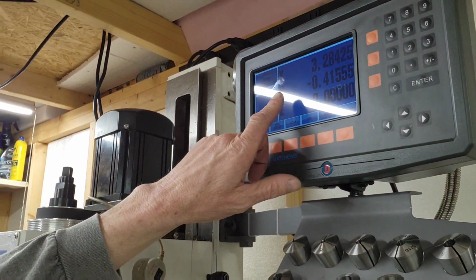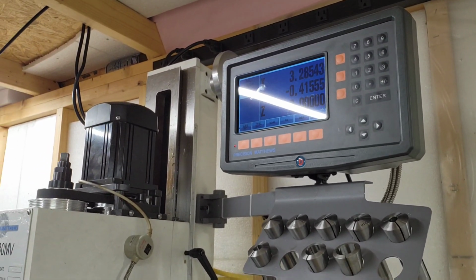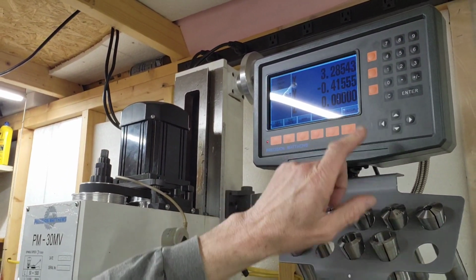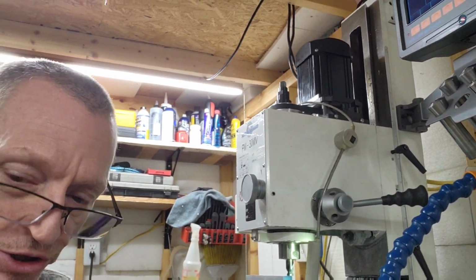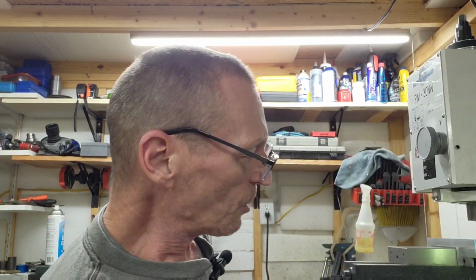Okay, so we're sitting at 0. Well, we're now at 415. We know it finishes at 430. So, oh, excuse me, that was center. I never zeroed. So this picatinny is actually 832 in width. And I just rounded mine off to 830 for now. It's only 2/1000. Its actual finished diameter is 832. And that receiver did measure 832. But I'm sitting at 415.5, which is only half a thousandth off of 416. Excuse me, 832. So anyway, we're going to set our 0 on our Y here, right dead in the center of the part. We're going to move over.